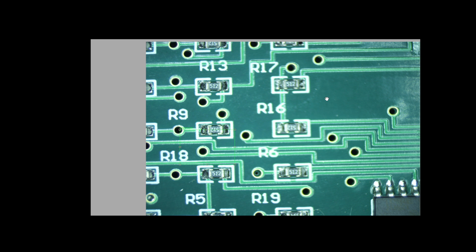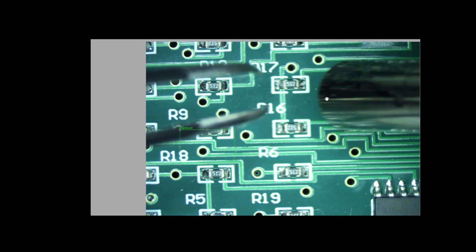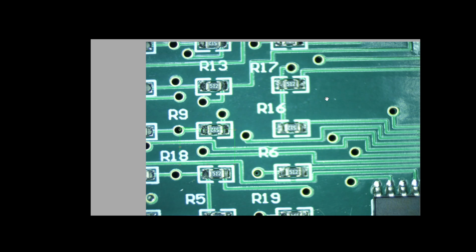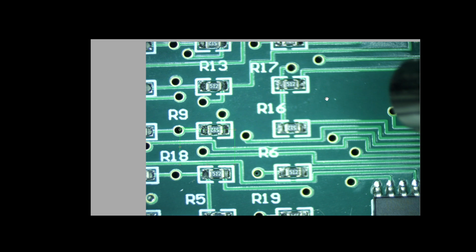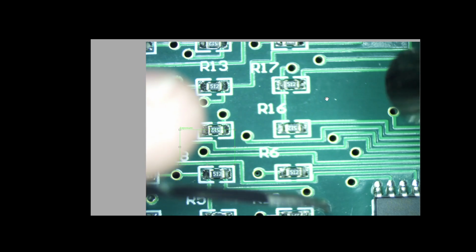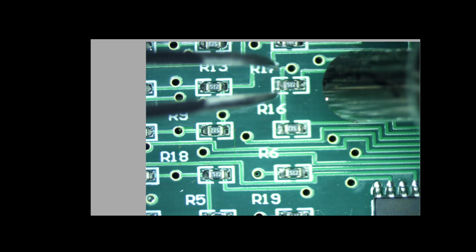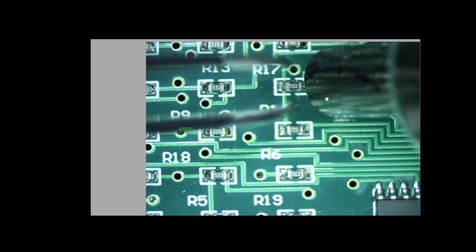Okay. So we're going to remove those two resistors now. We use the hot air tool. Pull the glasses off. And one thing I'm going to be careful of is not to get the hot air too close to that connector down here or the ones up there. Luckily, these resistors are in the middle of the board where they're easy to get access to.